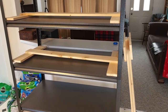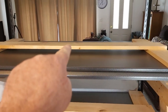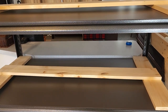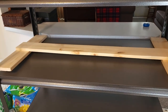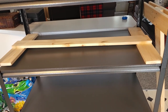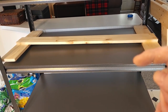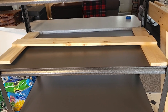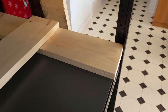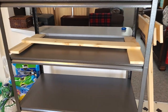I made my four light racks. I've got two there for the bottom shelves. This one here is going to be hung up on S-hooks and so forth. It's just a basic H-kind of design using one-by-six. My shelves are 24 by 48, so I went 47 by 23 — that gives me a little bit of clearance so when I raise and lower my lights over the plants it doesn't jam up. I've got four of them made.